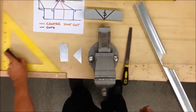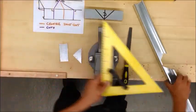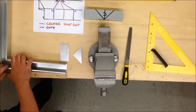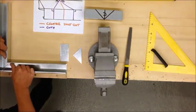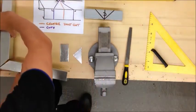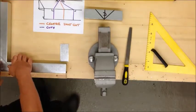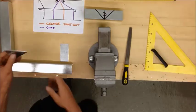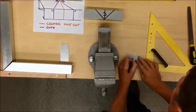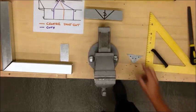Next up, you'll notice I've got a 90 degree angle set into this bench for these two pieces of timber. You get your trunking, ease it into that 90 degree and make sure that your cuts are accurate, which they are. I'm going to turn that over. This piece on the inside of the trunk is going to fit there and be riveted together to join the trunking back together and give it some strength. The first thing I'm going to do is mark a couple of places on both sides for my rivets to go.